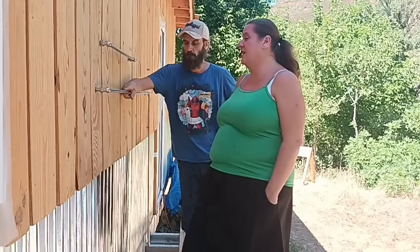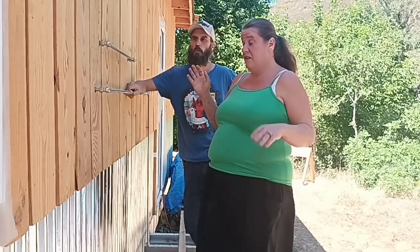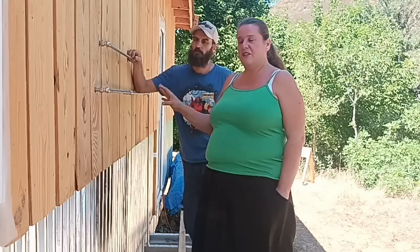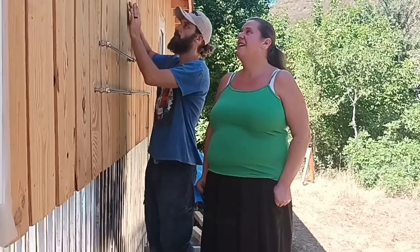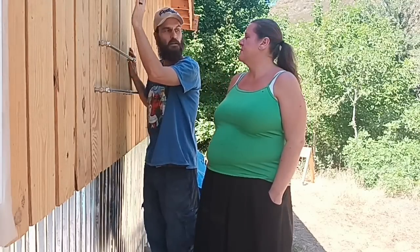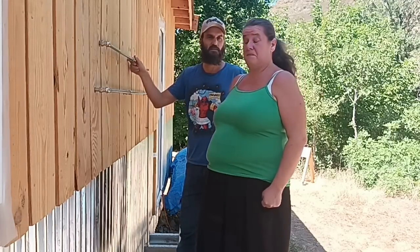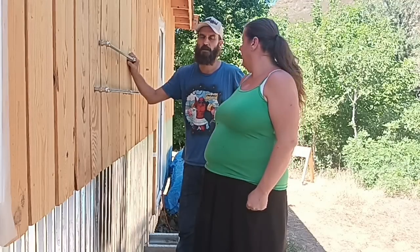Exactly. It means that for us, although our pipes are going to be outside of the house, we're going to have to keep an eye out for Mother Nature a little bit. If some kind of freak event happens and it does dip below -5 degrees Celsius, then we will definitely need to think about adding some extra protection on these pipes so that Dan's hard work just doesn't blow up in our face. Depending on how much the water heater is going to build out, we thought about boxing in this area with the same type of cladding as the house, so it just blends in. But now when we put up the pipe, it kind of looks pretty cool. So let's see what we do, but as you said, let's monitor during the winter and see if it's starting to freeze or if we need to put insulation on the pipes themselves. Anyhow, we're going to start like this, I think. Take it from there.